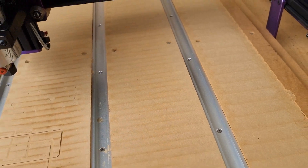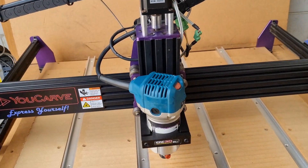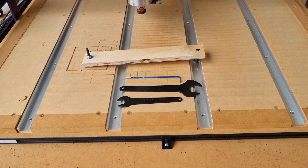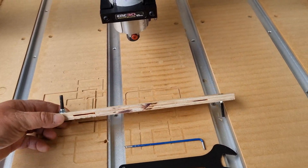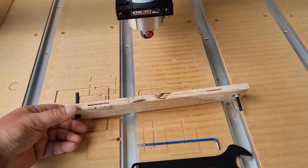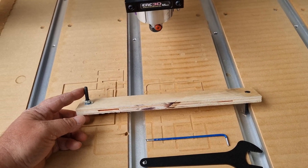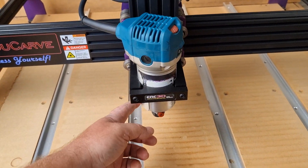We're going to go through how we can make a simple timber jig in order to tram this machine. You'll notice here at the front we've just got a couple of tools — something we've just made up. Basically it's just a piece of timber, 300mm long. You can use some treated pine if you want; we've just used a little bit of plywood. On this side we have a quarter-inch bolt because our router comes with a quarter-inch collet.